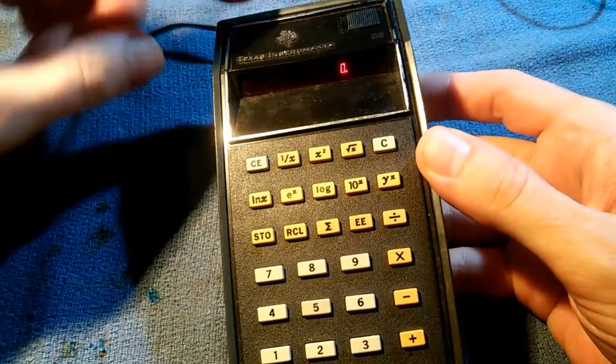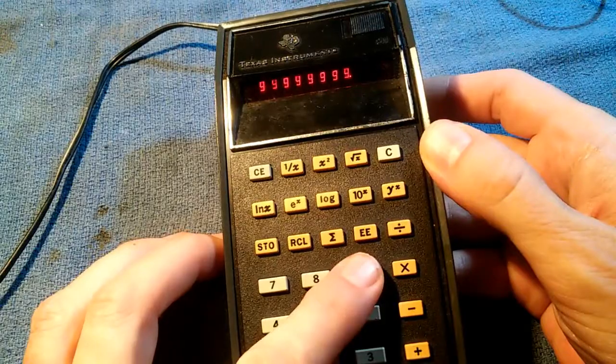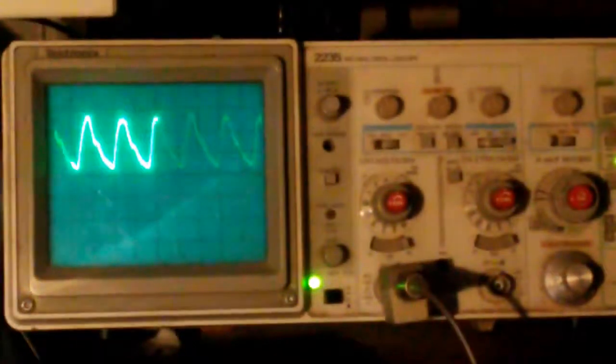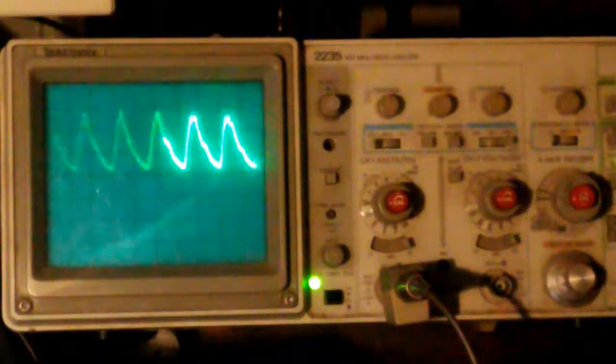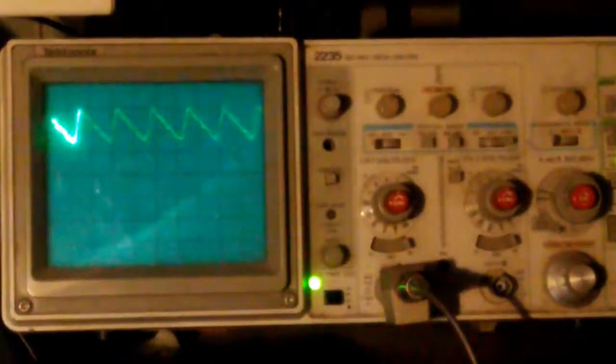These early LEDs were very power inefficient and really drew a lot of power. The more LEDs that are turned on, the more power it draws — in fact the display becomes a little bit less bright the more LEDs I light up. Let's see what that looks like on the oscilloscope as I add digits and increase the number of illuminated LEDs. As I illuminate more LEDs, watch what happens to the waveform — it drops lower and lower, all the way down to two volts. With all eight LEDs illuminated, the voltage peaks at eight and drops to two. When I hit the clear button, it just springs right back up. Those LEDs really pull a lot of power — each peak is separated by only a sixtieth of a second, just draining that capacitor fast.